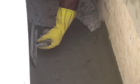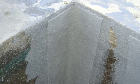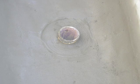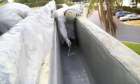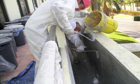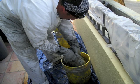There are three main steps to this assembly: preparation and cleaning of the substrate, the application of the primer, then the fleece membrane, and finally the application of the surfacing material. The process of preparing the surface is meticulous and includes extensive cleaning, any repairs needed to the surface, and the sealing of all transitions or corners and penetrations — in this case, the drain assemblies.